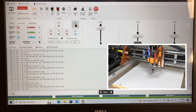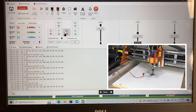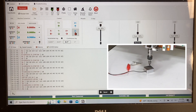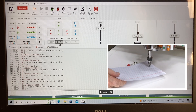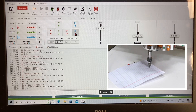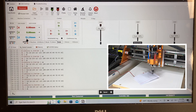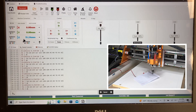I said I was going to show you a different way to measure the actual probe itself. So at this point, we're going to put the probe underneath and go through this process one more time. I'll switch to 0.01 of an inch and slip the paper underneath, then go ever so slowly until it just touches. We're at 0.60 of an inch — if I switch this over to millimeters, that's actually 15.24 millimeters. So that is the thickness of our probe itself.